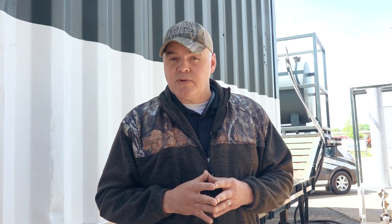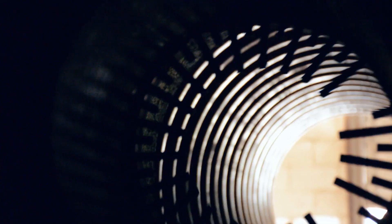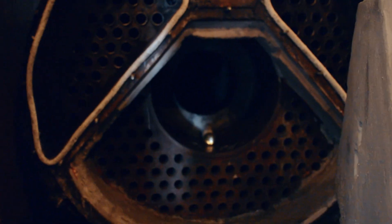The best method for steam boilers is to perform your annual open, clean, and close along with biannual tunings. Some operations may call for frequencies that differ from this, however this is good practice to keep your boiler's efficiency at its peak.